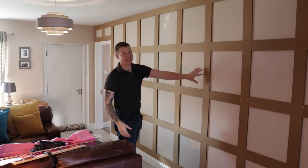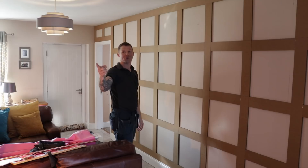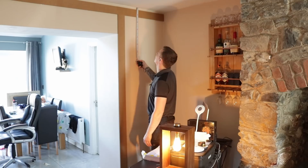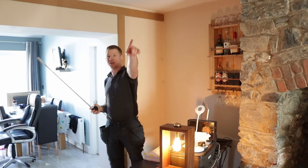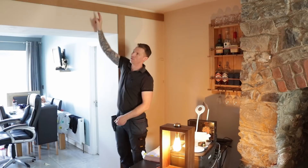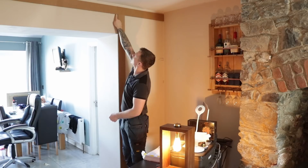It's nice and simple. The kit just to do this wall alone was nearly 500 euros — this cost me 50 quid and it's done most of the whole entire room. I have this portion over here to finish. I'll show you exactly how to stick this to the wall. This is a piece I have to finish. You can see the gap I have here — it's nearly 30mm, so over an inch. By keeping the top board level the whole way around the room, there's obviously a major discrepancy. By the time I got around to here it's actually 30mm — about an inch and a quarter difference. So I'm going to have to hide that either with coving or a fill piece. If I put coving on it, you'll see the straight line the whole way around. The best option would probably be to put a fill piece in here, fill it, sand it, and just have this one look slightly thicker. Then you'll see this line runs the whole way around the room in a perfectly level fashion.